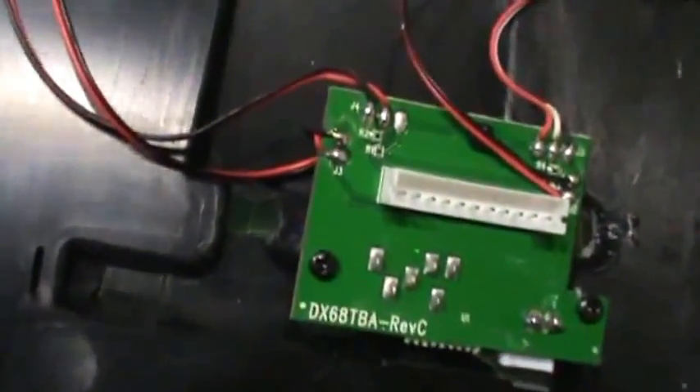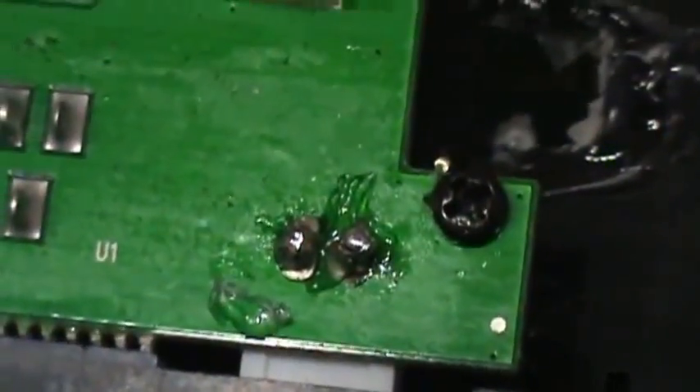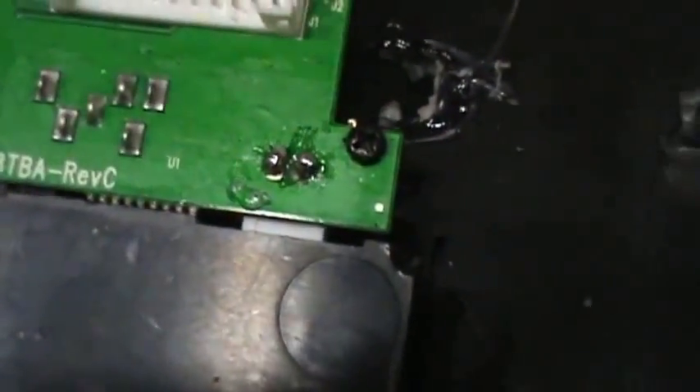What I've got done — I've just drilled out a hole here, soldered here, because this is your battery connection. Positive is on the left and negative is on the right, which is right here on this, so it's just on the other side of the board. I know positive right here is on the right-hand side just when you flip it over.